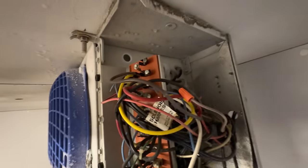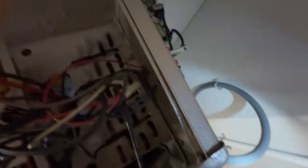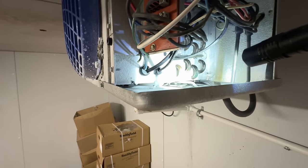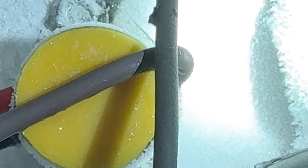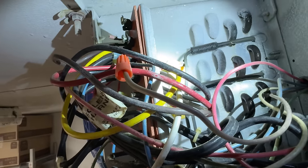This restaurant has been hodgepodge for a while and it's got plenty of problems. That thermostat could use a little help too. There's the switch with no cover on it — I've never been here before but I'm not overly impressed. See this right here — the plastic is split. The defrost termination is not working properly, so instead of replacing it somebody just bypassed it. And chances are the fans are probably not coming on.